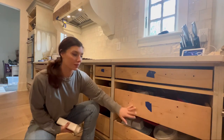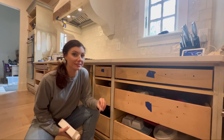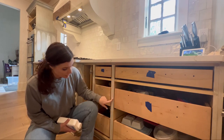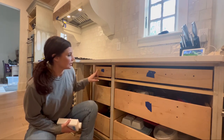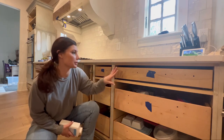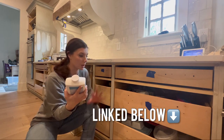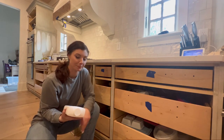Okay, now that I have all the cabinet doors off, the next step is going to be degreasing and deglossing them. You can see it has this glaze. So my approach for the cabinets is going to be using a brush and a roller to do the frames, because I'm gonna spray the door fronts, but honestly, there's just too much overspray to do it by the frames. So I'm gonna do that part by hand. We're gonna start using this liquid sandpaper. I'll do the fronts and I'll do all these spaces. And then after we do that, it'll be time to prime.